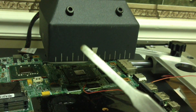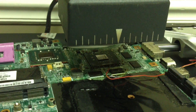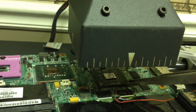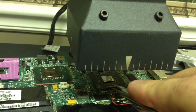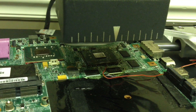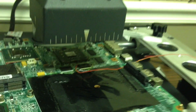I use a pair of tweezers myself to pull it off. We're going to let this get to the appropriate temperature, and you can bump the chipset in a corner like that and see if it'll move. By bumping it, it'll just trigger it to slide. Then we know that we can pull it up and lift it without damaging the pads or anything underneath. So we're going to let this heat up and do its thing, then start our next steps of actually releasing it and taking it off.